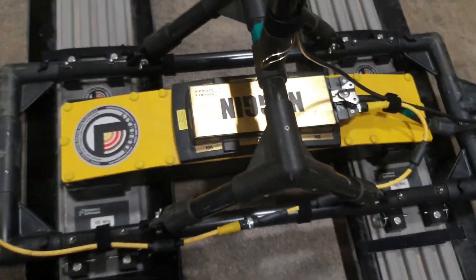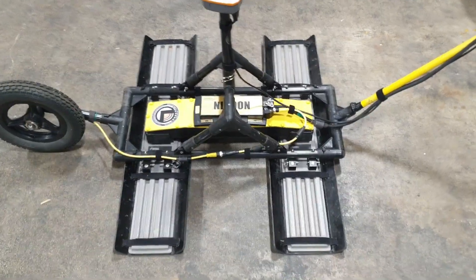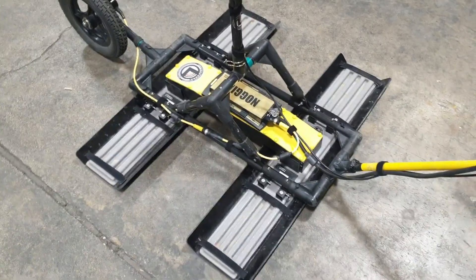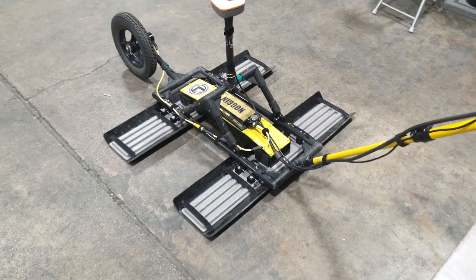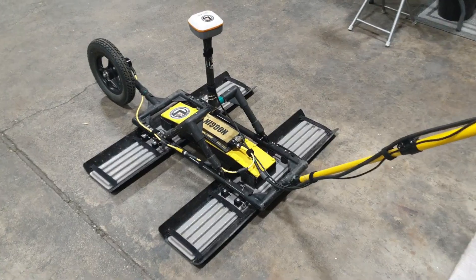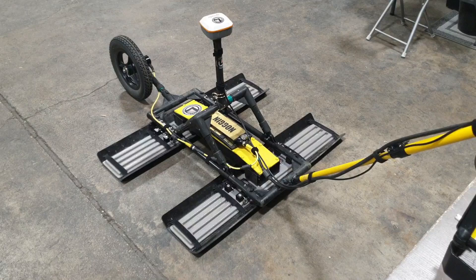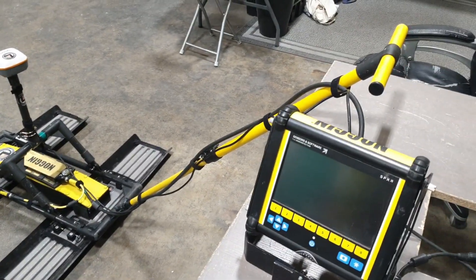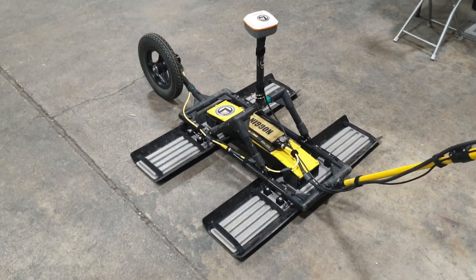It's got a transmitter and receiver antenna — I don't actually know which is which because they're interchangeable. This is an unshielded antenna, so it's ideal for use in areas where there are not a lot of things that can cause radio reflections. You want to avoid parking lots full of cars, fences, overhead power lines, etc. You can still survey in those areas, but you have to be aware you'll get those reflectors in your data. The customer we're doing this video for is going to be surveying on top of a glacier, where an unshielded antenna is just fine.